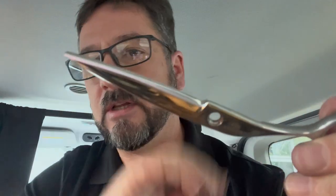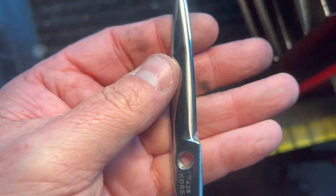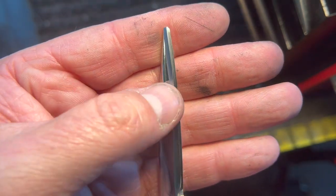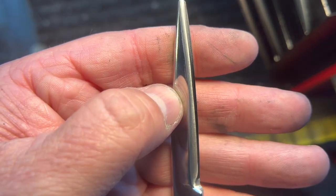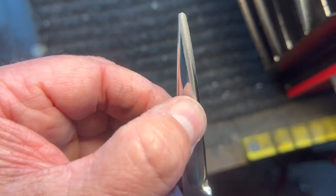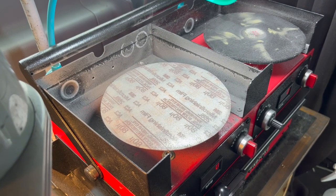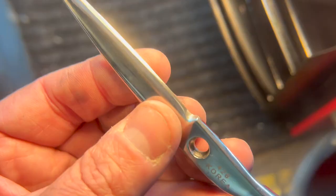What I found with this blade was the angle was way off. Switching over to the magnifier — I'm trying to sharpen this shear at about 50 degrees, and you can see I've started creating a double angle up above. At 55 degrees it only came down to about this point and hasn't gotten anywhere near the edge yet. To bring this in and completely re-grind this front surface, I'm going to have to switch to heavier grits: from an 80 micron to a 60, then 30, then 15, and possibly a 9.